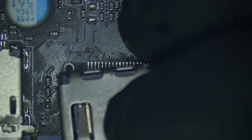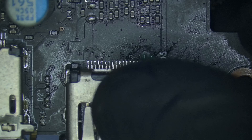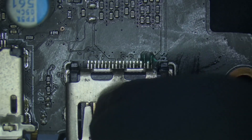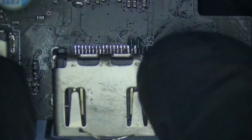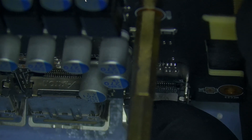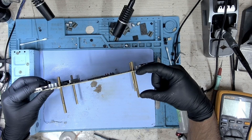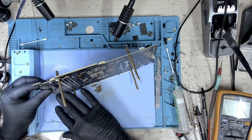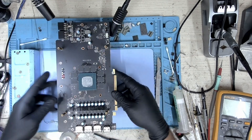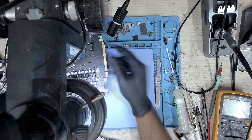The wires are in place. Let's check the alignment of the connector — it looks like it's slightly off. Let's try and make sure that we are completely aligned. Let's take a look from a different angle. It looks like we are pretty straight. Let's try and solder this now. I've extended the standoff so I can put my hot air nozzle underneath and heat it up, and try to capture it in the camera.